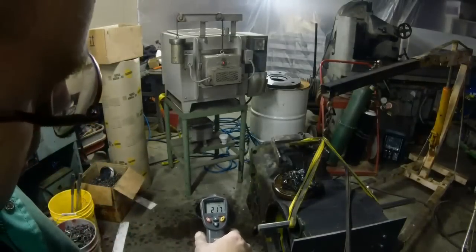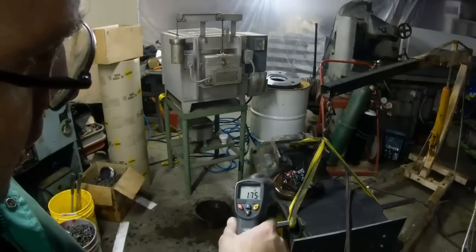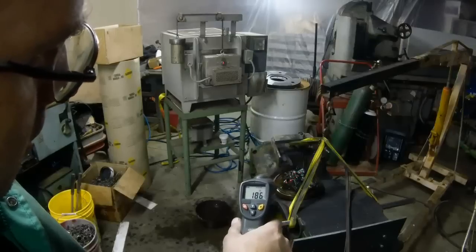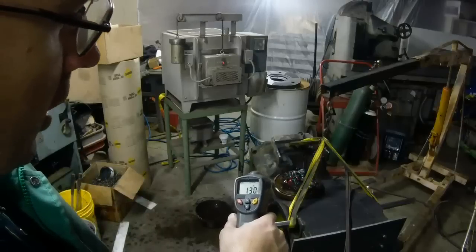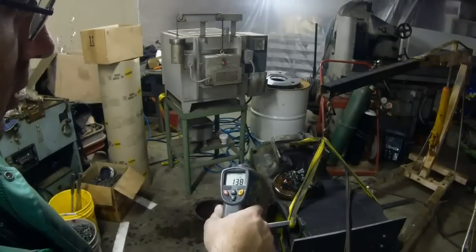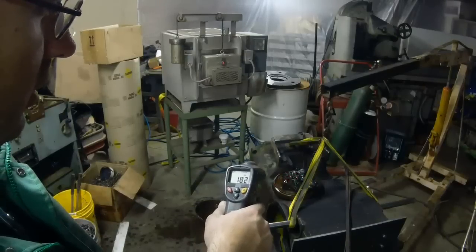Okay, so see the oil's about 225 degrees or so. The parts are in the 100 range, sitting there. So we've got a complete quench, didn't overheat the oil. Not sure how having the wrap on there will affect it, but I figure still quenching in the oil's going to be faster than doing it out in the air, and it says it's okay to do in the air. So we'll see what kind of Rockwell these suckers are after we temper them, and see how we did.